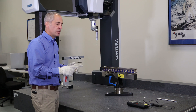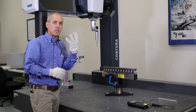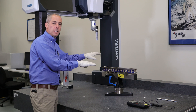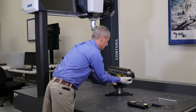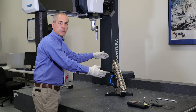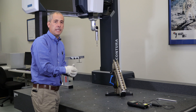In addition to those, they're going to check what are called spatials. Typically, spatials are checked in a minimum of four locations — each corner. In a spatial, the artifacts are set at a diagonal, which requires that the machine move in the X, Y, and Z directions, allowing you to map out or see any error in the entire measuring volume.